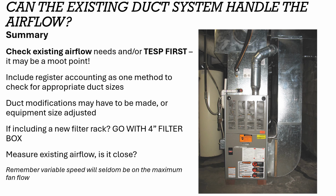So please don't forget, when you're doing the sizing, think through all of these components we've talked about, right? Understand the limits of the equipment to the load of the home. Understand the adjustments we make for sensible and for altitude. Understand the choices we may have to make when our heating loads are a lot larger than our cooling loads, and then definitely make sure that the new system, well, for that matter, the old system and the new system, can work with the ductwork present in this house. Put this all together and you provide the winning formula.